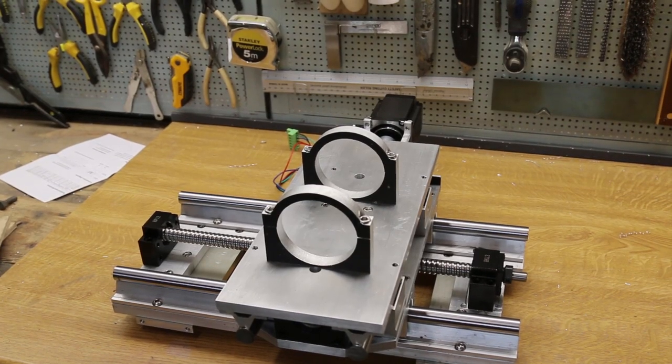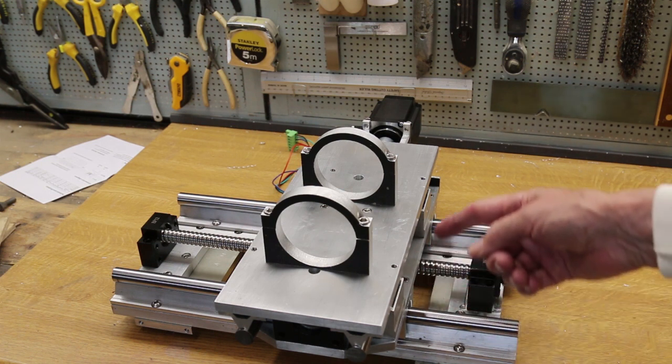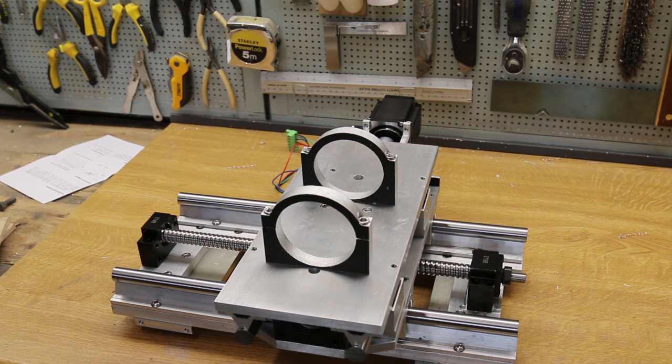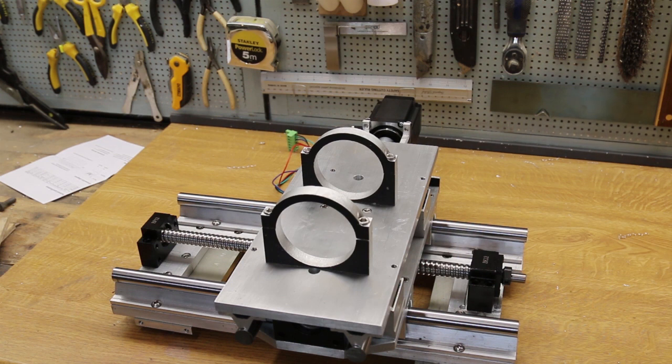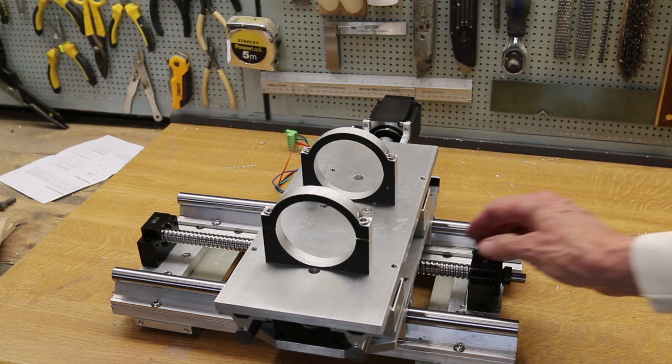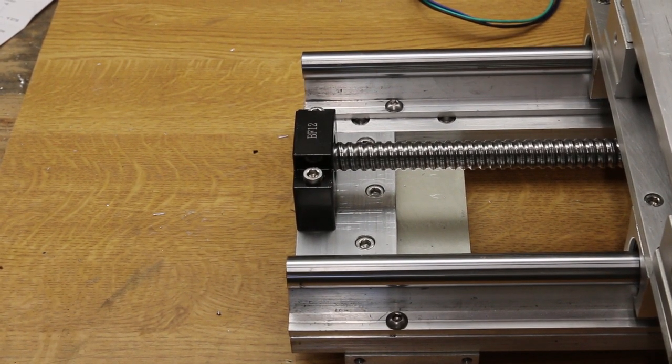There's no shortage of people on YouTube who have made a CNC machine for very little money using only hand tools. All I can say is they must be mighty good at hand fitting and have lots of time to do it — all those machines aren't very accurate. Having said that, there are times when hand fitting and hand measuring is better than using machines. A case in point is the ball screw on the x-axis. Because the position is dependent on lots of different measurements throughout the build, tolerances can add together, creating uncertainty. In this case a bit of hand fitting with, if necessary, a level of adjustment should do the job. The purpose is to make the shaft run as freely as possible. Because this doesn't affect accuracy — only smoothness — I believe it's the correct approach.